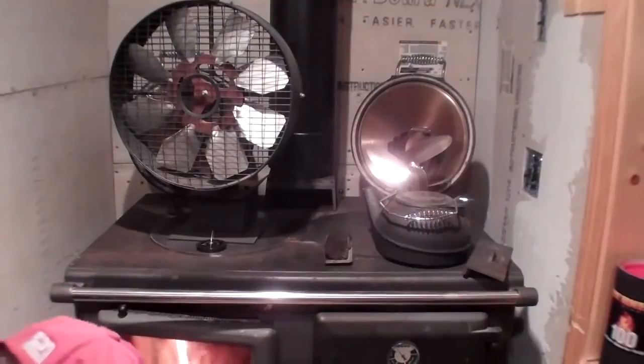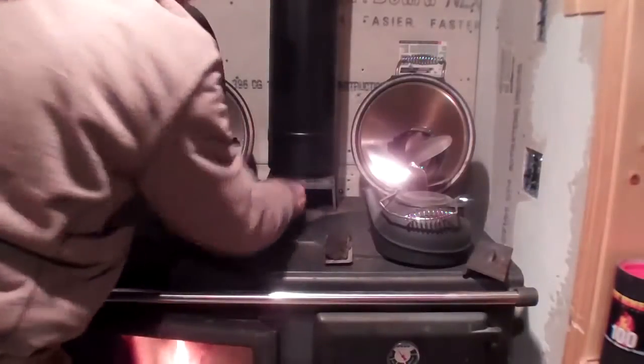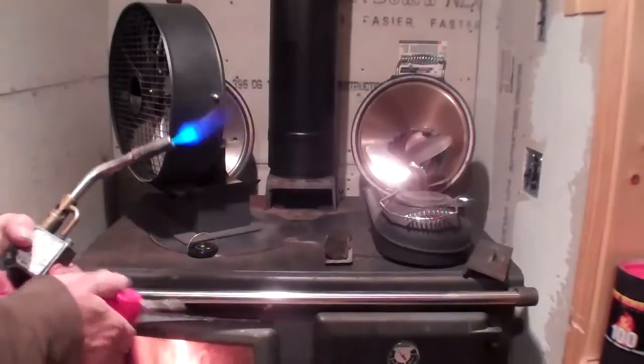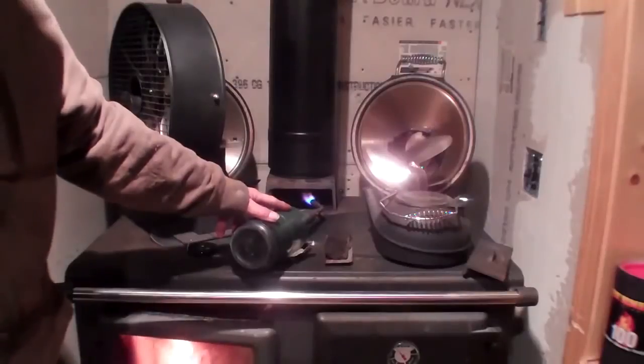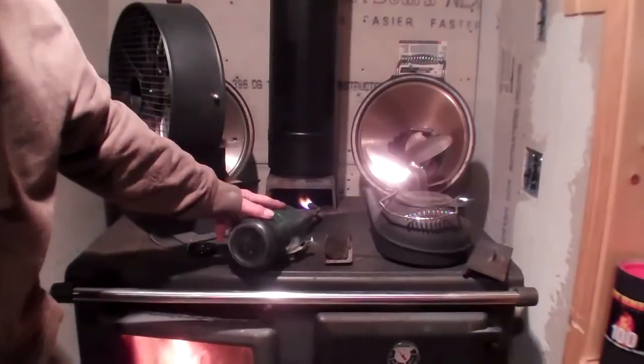This is what I normally do before I light the stove, but I'm doing it this way just to show you guys something. Now, you can see the smoke coming up. Right here, you can see that's the base of the chimney, and there's smoke coming out of it. I'm trying to demonstrate there's a reason why. The reason is not enough heat. You hold that right there for a minute, just enough to overcome that blockage that's in there. It's like the air kind of becomes stagnant.